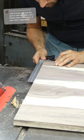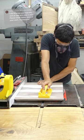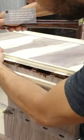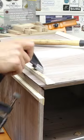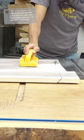Now for some bottoms. Again checking for accuracy as I go, I'll make the bevel cuts on each end so it fits between the vertical components. To get the panels to drop in, I'll use some clamps to pull the verticals over a bit and widen the top enough for the dominoes to drop in. A bajillion clamps on the cauls and these case bottoms are all set.